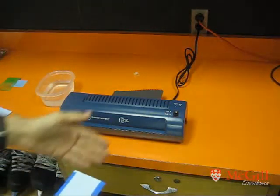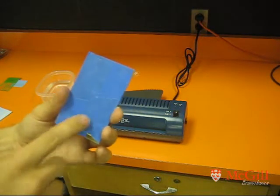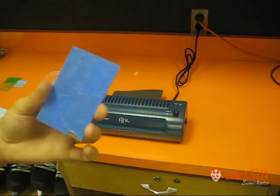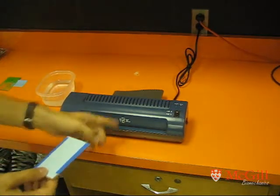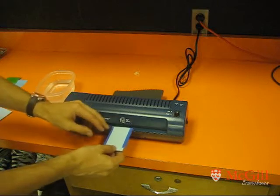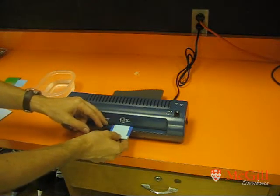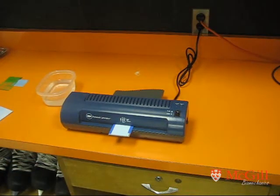So now we're ready to laminate. Just before I feed this through the laminator I put some masking tape on the bottom of my cleaned copper that we etched earlier, just so I don't scratch it up — there might be dirt or something in the rollers and I don't want to get anything on my nice bit of work. Just like before, wait till it grabs and let it do its thing. We're going to feed it through four times, reversing it each time it goes through.